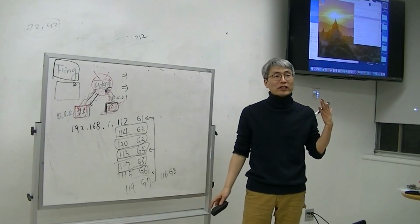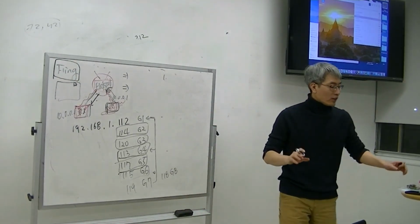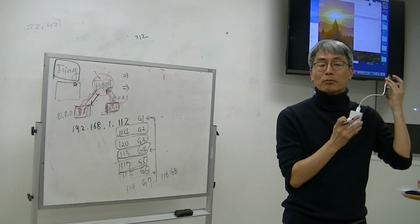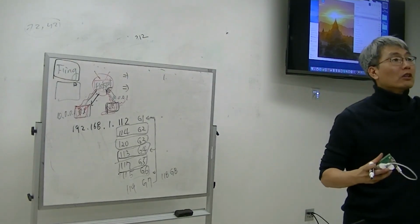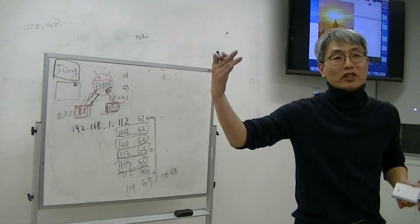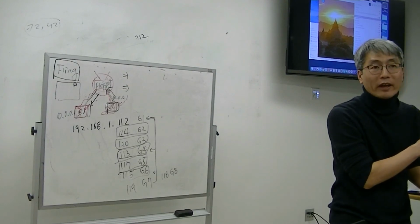Once you get used to this, the next step will be every time just simple. Okay. So first, this Raspberry Pi remembers all your Wi-Fi information unless you modify the file. Later I will explain how to manually modify that. Right now you have this, and also your hotspot if you successfully connect. Which means the next time you restart your Raspberry Pi, the first one will be checked. If not available, the next one, and so on.